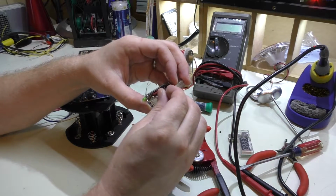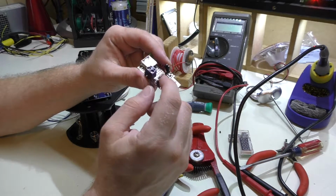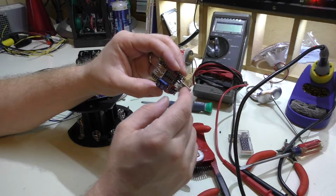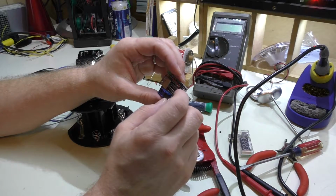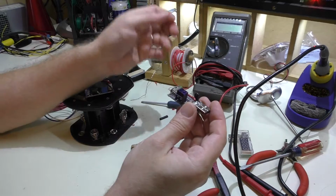So then I started thinking, after I put this together, there's definitely a better way I can engineer this. I can do it where there's a diode, so if you have power connected to here and you have this hooked up to something, it won't accidentally send the power into your device and fry it. The other thing I can make it do is actually remove the power completely from whatever device this is plugged into and use it to power the thing externally.